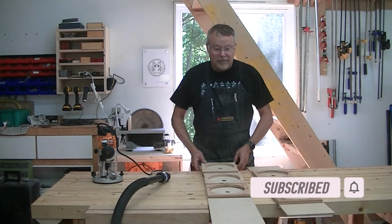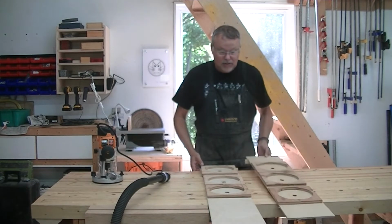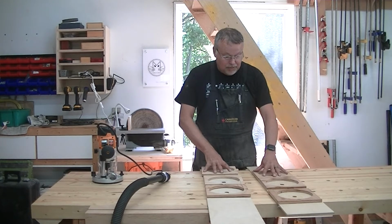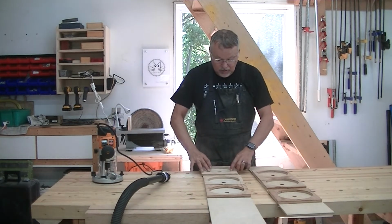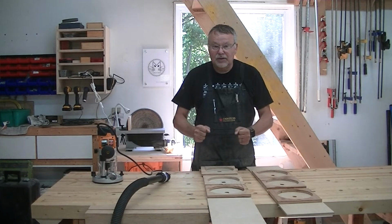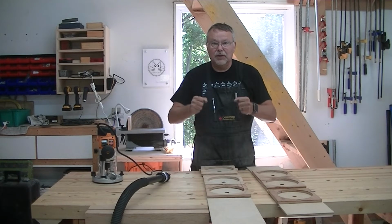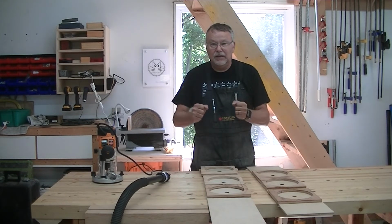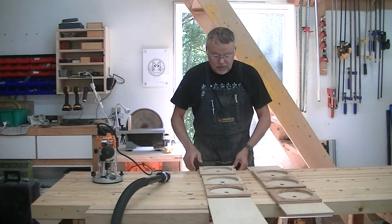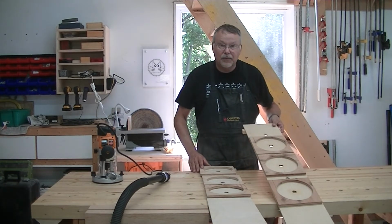So just as a recap, I have two jigs. This is the first one that I created. This is the second one. In both cases, what I've got are holes, or these templates where the router base sits. Very solid, very secure. I'm able to plunge the router bit straight into the material, lift it up, stop the router bit, and nothing moves. The first jig was used to drill the first 3 holes that I've got, and the second jig is to drill the next 3 holes.